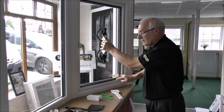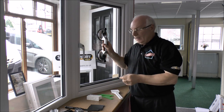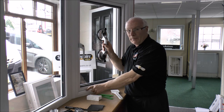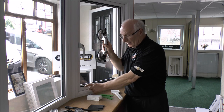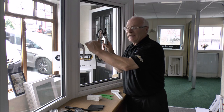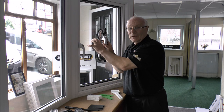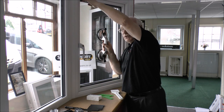The intention is that we are transferring the weight from the top corner above the handle across the glass to rest comfortably in the bottom corner below the hinges. The weight distribution is pushed over, and the reason we don't put a packer underneath the handle at the bottom is so that we can adjust the height of the sash, using the strength of the glass as a pack to pack off the top.